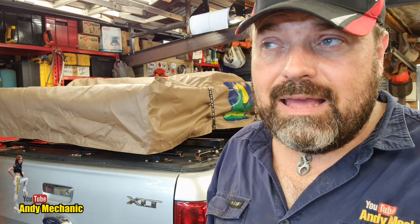If I'd done things differently, my suggestion to you is to make sure that you purchase a single sheet of plywood that's the right thickness. Me using two thinner sheets and having to glue and screw them together massively increased the workload involved. I think it would have made a better and tidier job with a single sheet rather than two glued together.